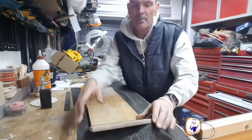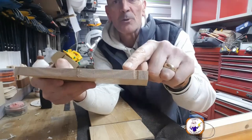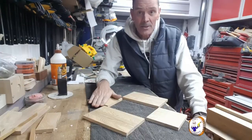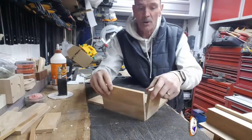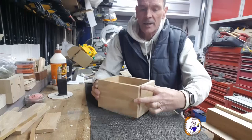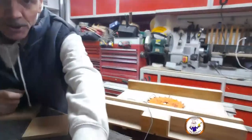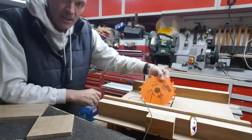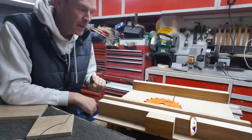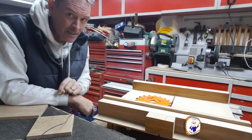I'm going to chop a bit off the ends because I've still got things like runner holes, so I'll chop a bit off here and here to give me 120mm in the middle. These are all now the right height and the box is going to be something like this. Now what I've got to do — as my last couple of videos were building up to — is change over to my finger joint cutting jig, which is this table with this blade. Mount this on the table and we'll be ready to cut some finger joints.